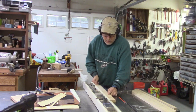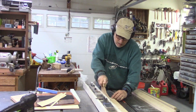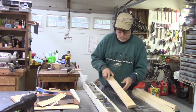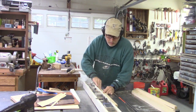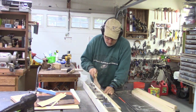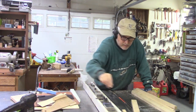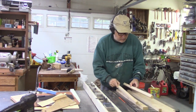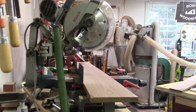This has a helical head on it and gets really smooth cuts. From there I had to start ripping up the stock. This is just standard milling and just had to make the different pieces. The trick to this is you have to have four different glue ups. So here I'm just milling up the maple. These start out at seven eighths by seven eighths and the length of this is roughly 25 inches.